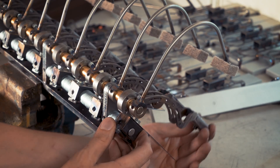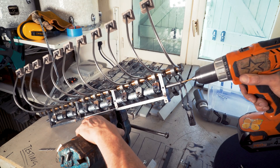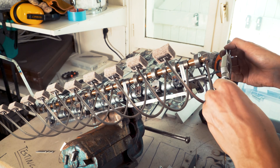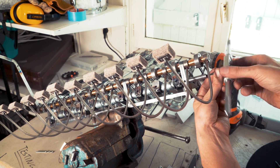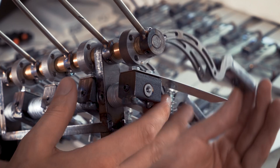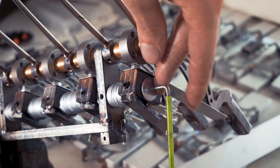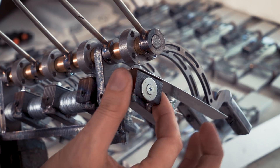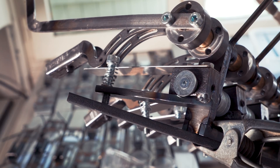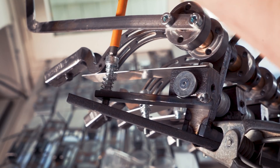I need to drill and tap in the end of the shaft to prevent the outer ones from sliding out. This screams potential disaster, doesn't it? I never break taps anymore — I have to fake-break them to create tension nowadays. This set screw is now obsolete. I can completely remove it, because this is the new height adjustment. This is what I have dreamed of.